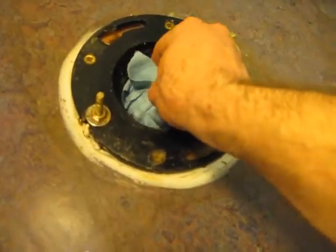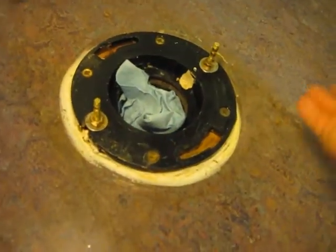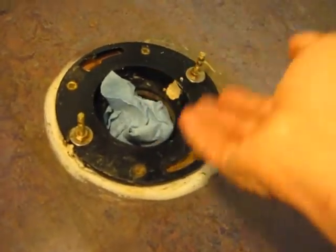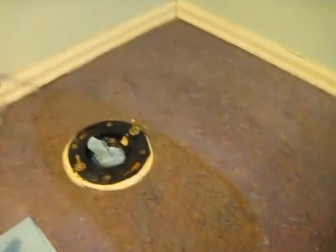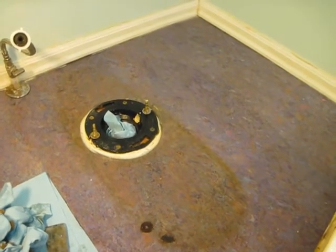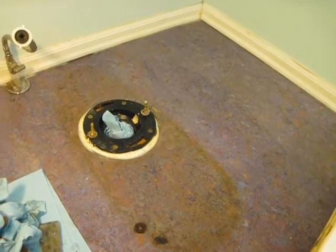I put this little napkin here, or paper towel, to kind of seal that off. Just when I clean it off, I didn't want wax falling in, plus, you know, there's sewer gases coming up. And I try to clean the seal off as best I can. So there we have it. We took the toilet off, and now we're ready to replace the new seal and reinstall the toilet. And so that'll be the next video.